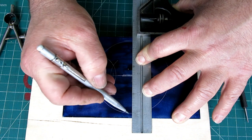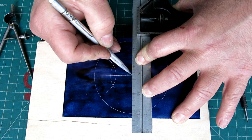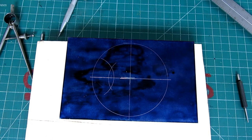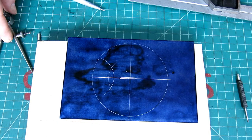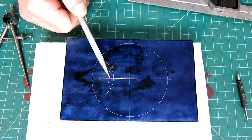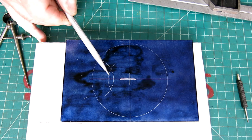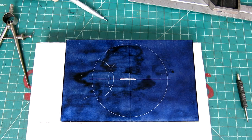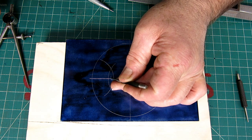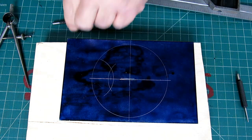Okay, I'm just gonna do it this way because I'm really lazy. Okay, and you hear that click because we went into the punch mark, okay? All right, so now these are at right angles to one another, okay? So our next move, so we created this point here. Now we're getting ready to really do the pentagon here, because we're going to start right at that little point right there. And I'm going to put a little prick punch in there. Make sure I got it. Yep, that looks pretty good.